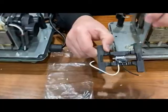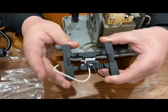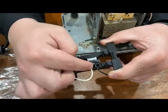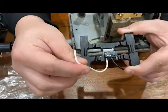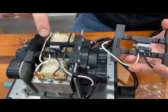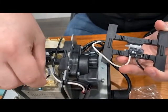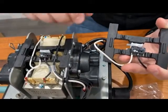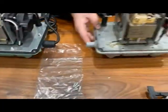This would be the new part that we get from the factory or the manufacturer. This is the assembly, and the connections are already made for us — there are already wires soldered in. So I just need to disconnect the wires that are already on the unit. This wire comes over here, so we'll unsolder that. This wire comes over here, so we'll unsolder that. Then we'll unscrew this and we'll be able to take this unit off, then put the new one on and make those connections.